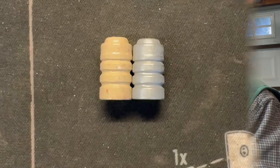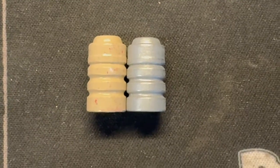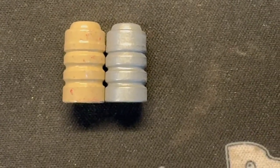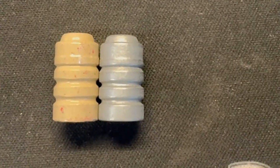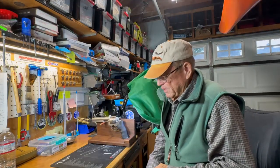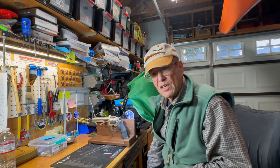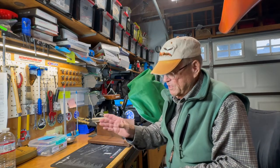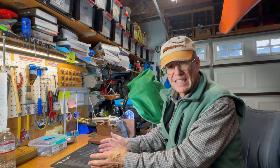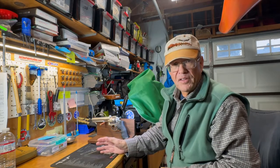So anyway, here are our two 358432 bullets from Lyman. On the left is the lead bullet, 160 grain version, and on the right, same mold number, from Andy 79Z28 in zinc, weighing 96 grains. So there you go with all of the casting stuff that we did with that one. Again, didn't make very many, but what we'll do next time is get them loaded up. I'm going to load all of the ones that I cast and the ones that Andy sent me. We're going to load them with the die settings exactly the same and with the same charge, and then take them to the range and shoot them and chrono them and see how they compare.